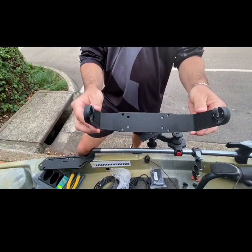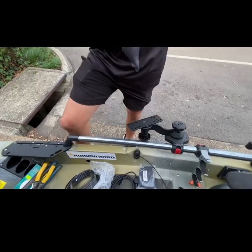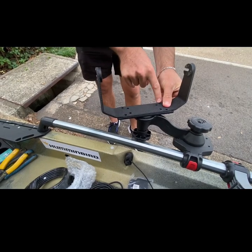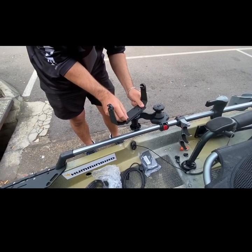You'll see here we've got eight holes in the mounting system for the Helix, and on our Ram mount we've got about 12 holes that are lined up. The key here is just to find that placement — we'll see that they're on these two outside holes. We'll grab our little nuts and bolts, 316 stainless steel with nylon nuts, which will stop any vibration from loosening them.